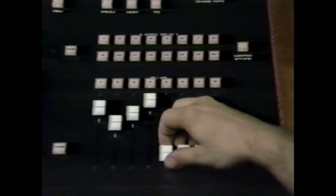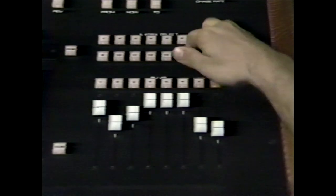Our direct cue controls give immediate access to any cue for rapid stepping between sequential scenes. Our crossfade controls allow intensity crossfades between instruments, as well as movement crossfades of instruments from one position to another. Our chase controls provide timed steps through programmable groups of cues. And our matrix controls allow grouping of instruments to sliders, 8 sliders per scene, with a capacity to store 16 scenes.